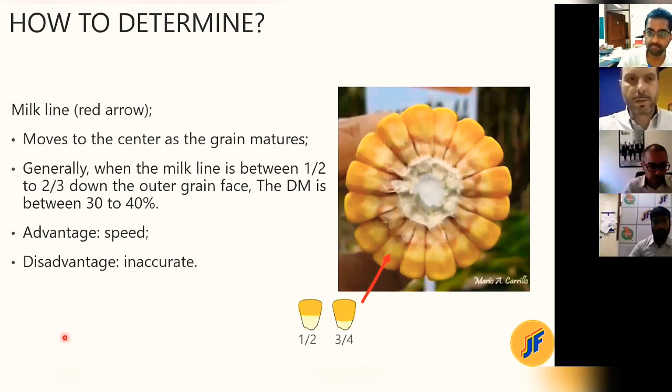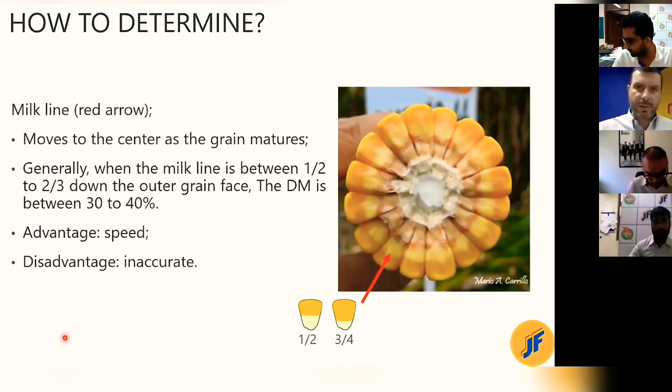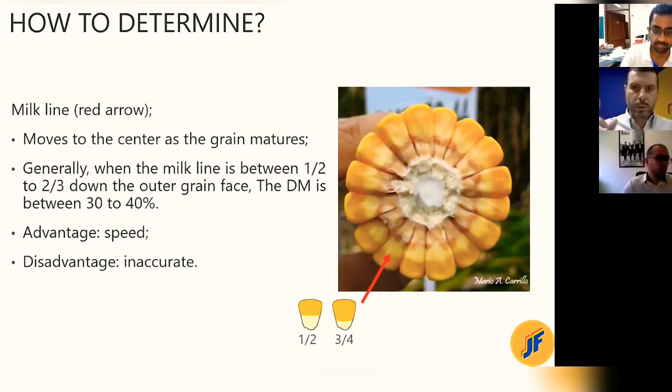Mauricio, here's Rafael. Just a little addition. As you guys saw, it's very important for the dry matter content to be in that window that Mauricio said. And the forage will dry quite fast, from 0.5% to 1% per day. So when you choose a machine to cut or harvest it, you need to choose a reliable machine that doesn't break too much, and a high productivity machine, okay? A fast machine that can chop as quickly as possible so you can make sure your forage is in between that harvesting and chopping window, okay?